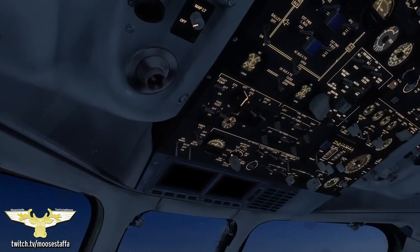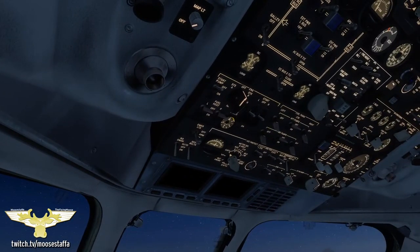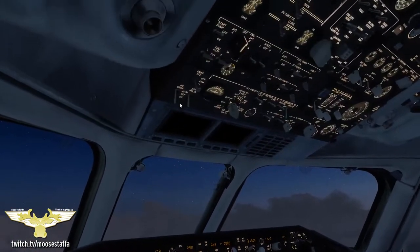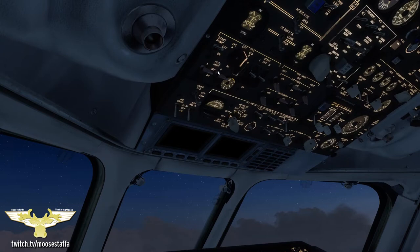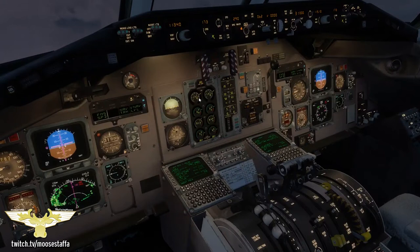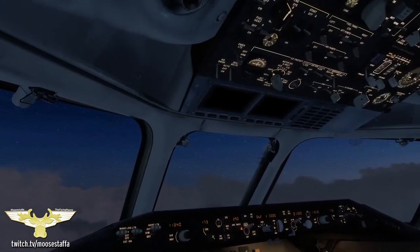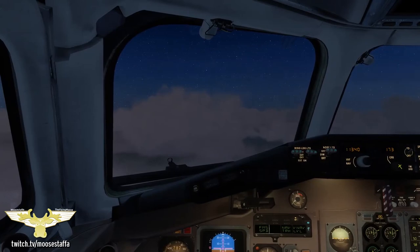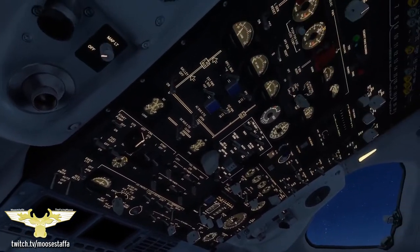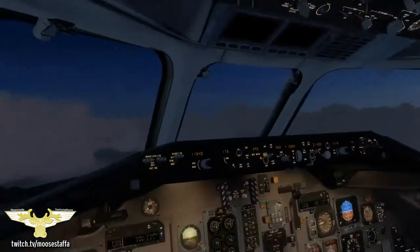The fuel heat switches, which are right here, basically what that will do is it will turn on a fuel heater for a minute on each of the fuel filters, and you'll see these numbers increase quite dramatically, and then they will automatically cycle off. So you'll hit these on and they will just spring back to off. It'll have activated the fuel heat for a minute cycle, and when that minute ends, you'll see the temperature start to fall back again, and you just keep watching the fuel. If the fuel gets into an issue of freezing temperatures again, you just hit those fuel heaters again. But they're not designed to stay on, so they will flip down and flip right back up. Just know that that's normal operation and not a design flaw.